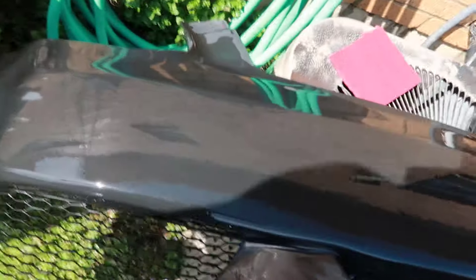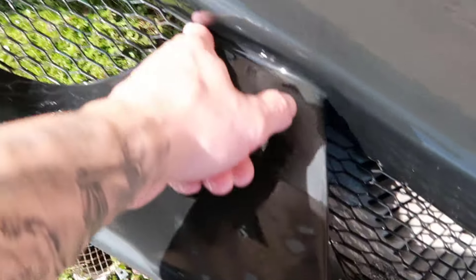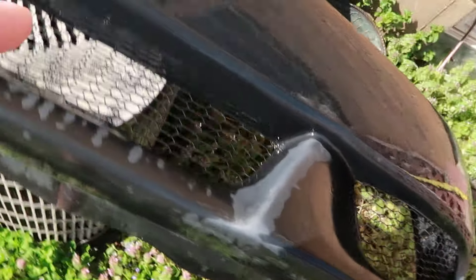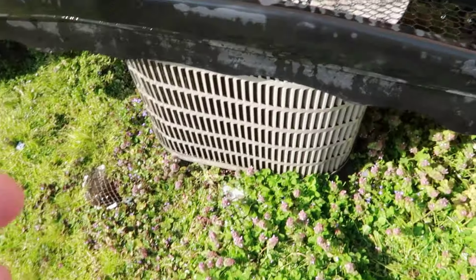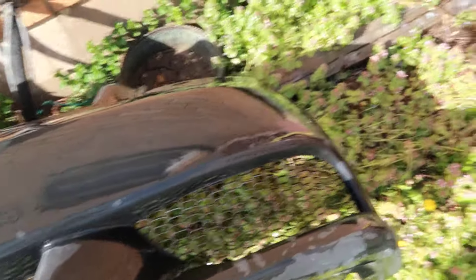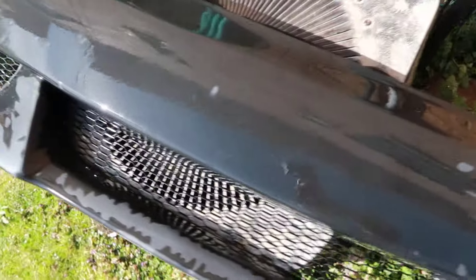You want to make sure you get through all the little crevices and whatever — right here, like the corners. Because if you paint it and that stuff isn't completely sanded, that's when you get the paint to just chip away quick. So now we're just going to wait for it to dry, see if I have any more work to do on it, and then if not, clean it up and then prime it.